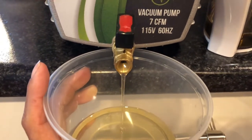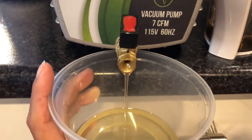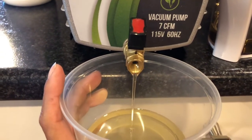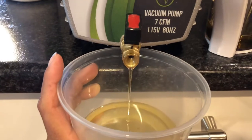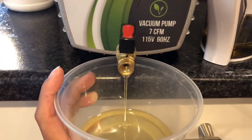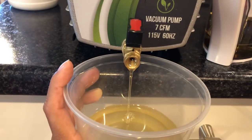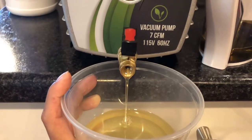I already have clean oil in the filter and ready to go. What will happen is the oil level will actually get low in the pump when you're cleaning it, so you kind of have to tilt it forward a little bit just to get the last of the oil out. Other than that, this takes about two to three minutes to drain out, and then once that's done you just put in your new oil, close it back up, and hook it back up to your machine and you're ready to go.